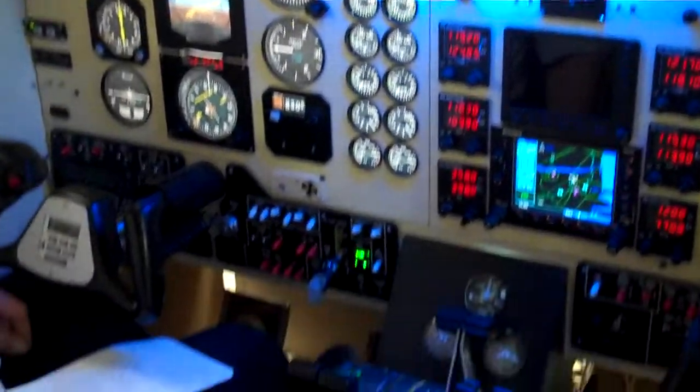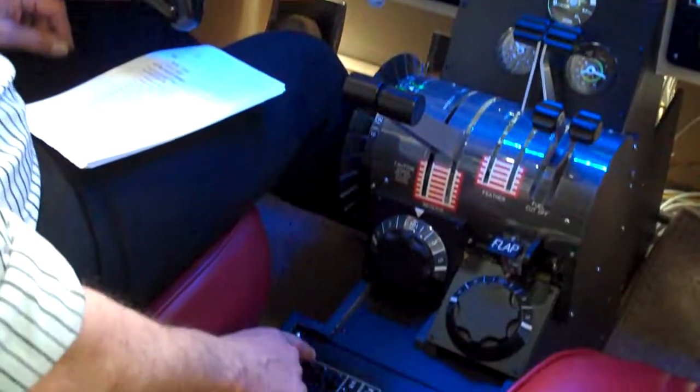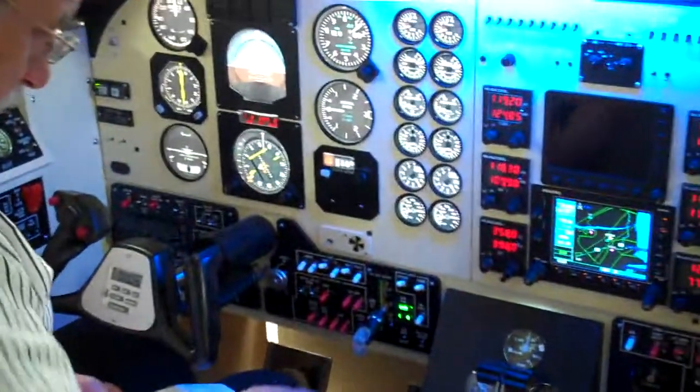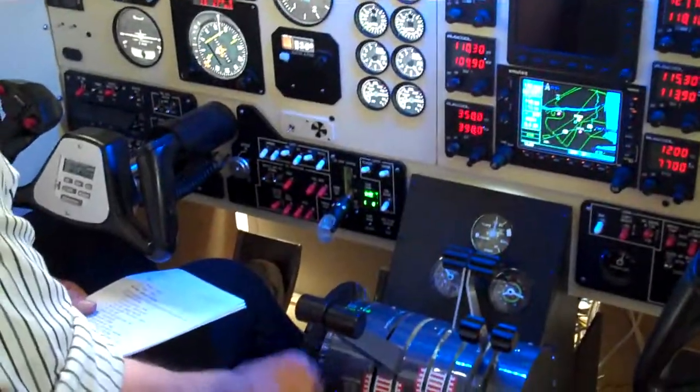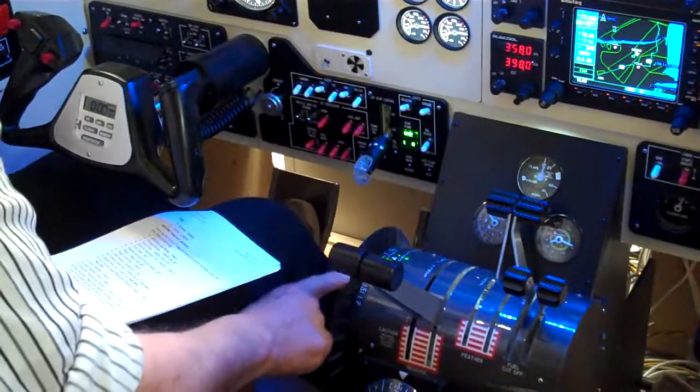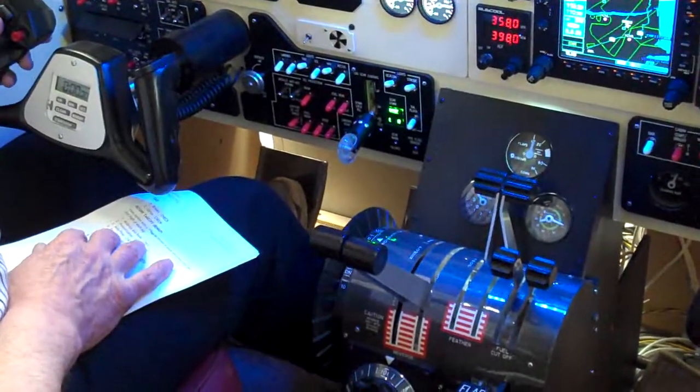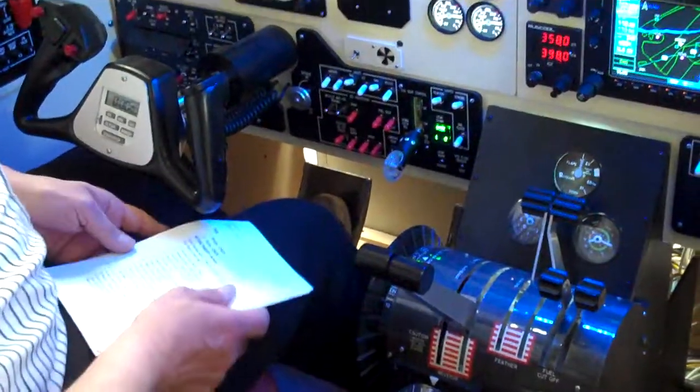We'll deselect these guys again and turn off the autopilot. Deselect that and roll back to standard again. We'll check the trim. We have manual trim down here with our wheel and our scale, and we've got electric power trim as well. Trim for take-off is zero units.